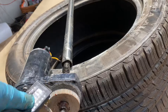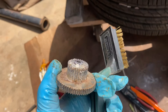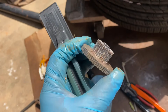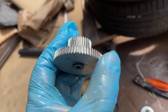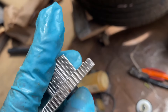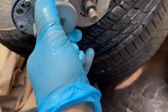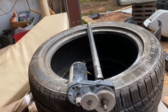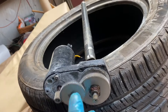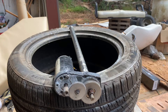As you can see, there's just junk in these gears. This one comes out — see that corrosion? I'm going to hit it with my brush real quick. I can't do it and hold the camera at the same time, but let me clean this up and show you in just a second. There's that gear I pulled off. Hit it with a little bit of brake clean — cleaned it right up. I'm going to grease that little shaft and then slide it back on there and put this thing back together. Then we'll do a test run before we put it back in.